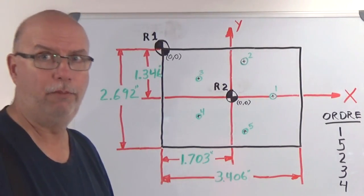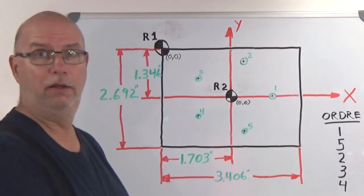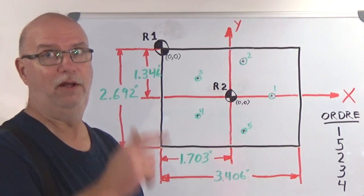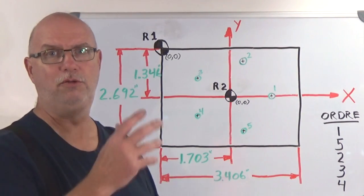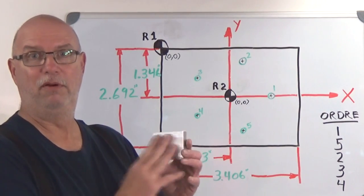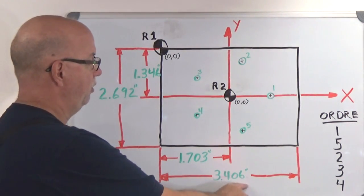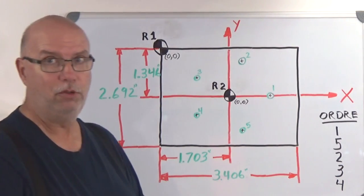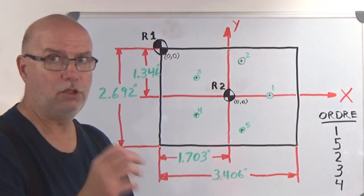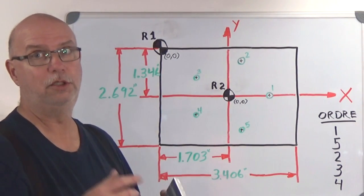I have a sketch of what I want to produce. I'm just going to be spot drilling or center drilling a bolt hole circle on this rectangular part. Now if you're doing a bolt hole circle on a round part, it's a lot easier — you just indicate your circular part, find the center, and go from there. But in our case I chose a rectangular part, mainly because I went to the scrap bin and found this chunk of aluminum and squared it up quickly on the mill. This part measures 2 inches 692 thou by 3 inches 406 thou. We're going to be producing five equally spaced holes on a two inch diameter bolt hole circle.